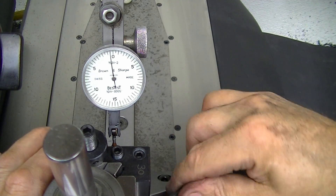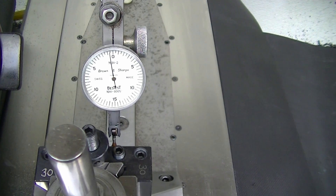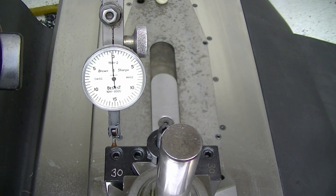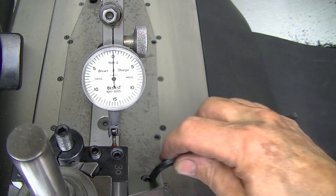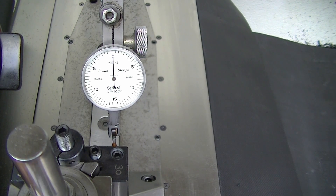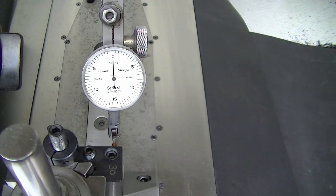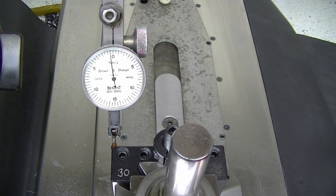Indicating this in ensures a repeatable alignment of the tool post when putting it back on — which is important when going back and forth between this block and the compound. It also ensures the drill chuck and the Morse taper socket are truly parallel to the Z-axis, which is very important. The four M8 bolts and the very wide stance of the mounting ensures this thing is basically immovable. I hope you found something interesting or informative in this — if you did, please subscribe, tell your friends, and share.